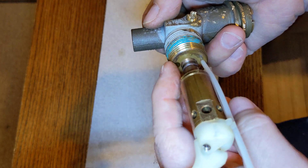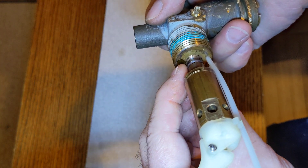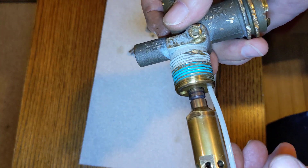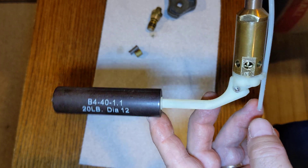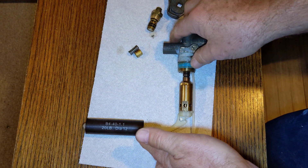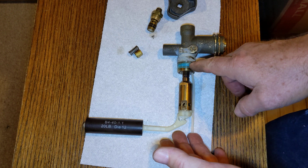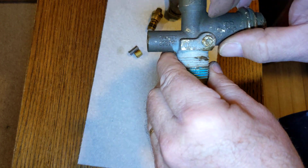Down under here you've got the port — this is inside the tank, so this port feeds up through the relief. Then you've got your dip tube. When the tank is full this float will rise up to the stop, and it's right at the level of the dip tube — it's four inches in the tank, hanging down four inches — and it feeds up through a port to your bleeder screw.